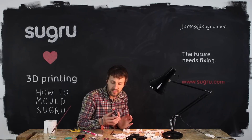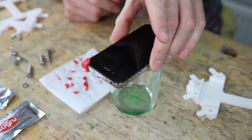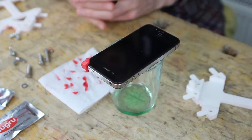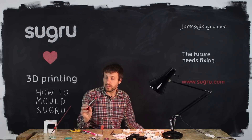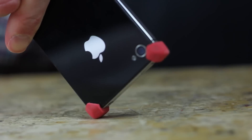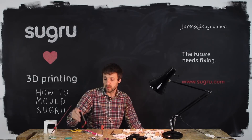When all the flash is removed and this is clean, just leave this to cure overnight by resting it on something like a glass, making sure that the Sugru isn't touching any surfaces. In 24 hours that'll be a very durable rubber. It'll be pretty good overnight but before you do anything aggressive, I'd leave it a full 24 hours.